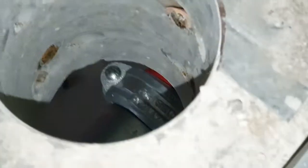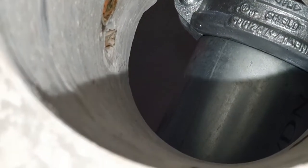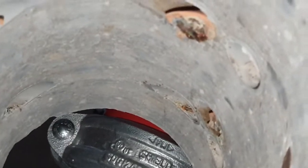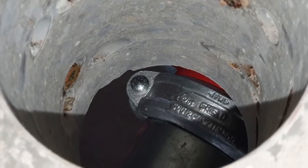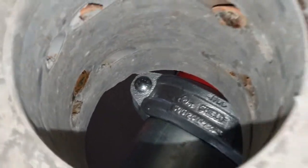There's the issue — that little conduit is supposed to join up there but there are a few conduits in there that they've unfortunately nailed. Hopefully what we can do is pull a little bit out from that way, get some slack, and do a join in here. If they're going to refill it, maybe the concreter can do something — we can fill this hole in or chip it out. I'll have to have a think about how we can fix it.